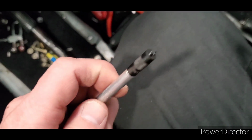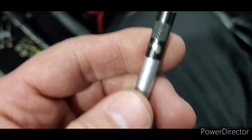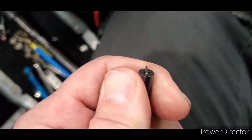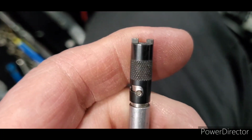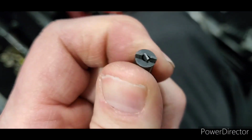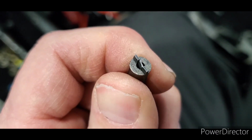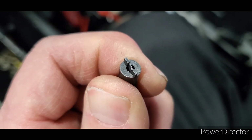And then they also have a straight slot style. You look at that end. Now what this has is, you see that slot with the cam. Turn it. Push it. Let's see if I can do this one-handed. All right. Now it's locked in place. You stick your slotted screw on. You push. And see how that is twisting? That part in the middle? That's spring loaded, and so the spring will grab the inside of the slot and hold, and you can start your screw.